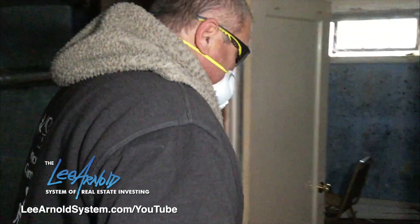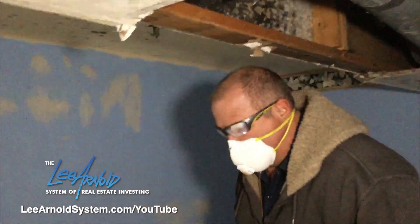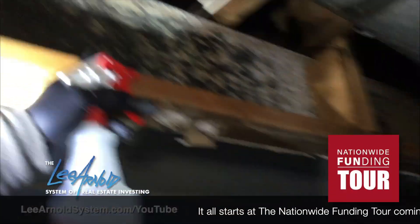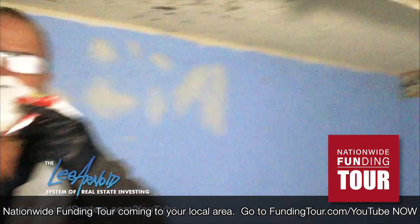We'll go into one of the bedrooms. You can pan around and see that this is not sheetrock texture paint — this is mold. Sometimes you get some really pretty colors that you might think someone textured the walls that way. Normally we'll pull the sheetrock down, but this sheetrock has already come down, so that gives us the opportunity to look up into the cavities. As you can see, there's mold on both sides — it's on the backside of the sheetrock too, which tells you it's gone through on both sides.